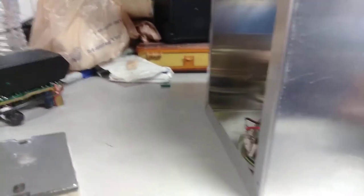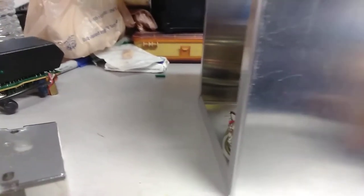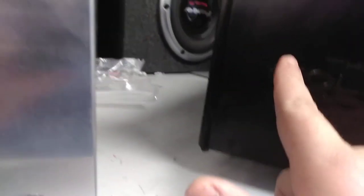So today my goals are to finish cutting the holes — I need to cut holes in the bottom for the speakers and drill a couple of holes to mount the solid state relay. I also need to drill a hole for the strain relief for the cord that'll be coming into this thing. I'll have a couple more holes to drill for switches and stuff. I also want to go ahead and put my thermocouple in — it'll go somewhere around here, and I might get to it today or I might not. I need to put a couple of holes in the side for the element leads that'll come out through insulators, so those have to be fairly generous holes. I'll probably make another little video updating the progress.